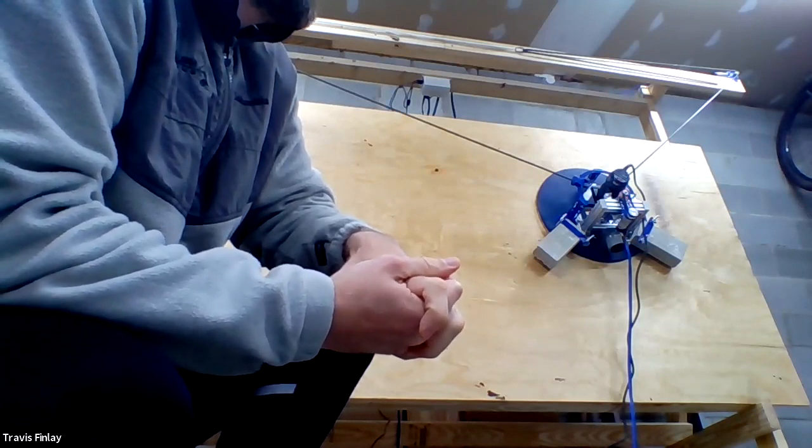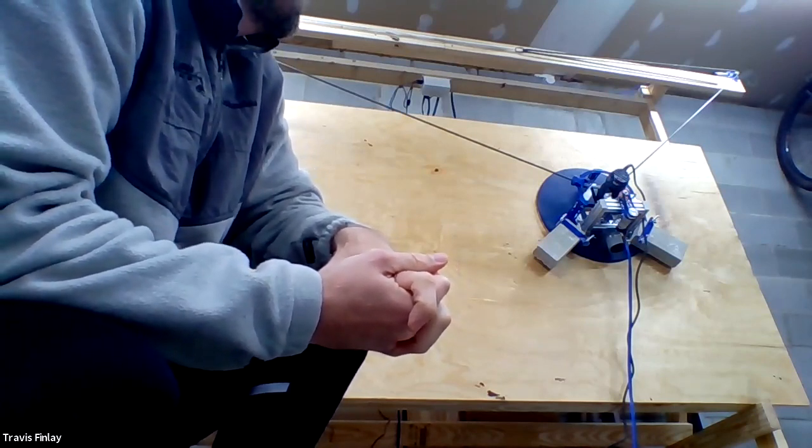All right, so on your feedback in the Makerverse application itself, what is your XY position that it's reporting? So like if you say, hey, I'm at 0, 0, I want to go to X150, Y0. When it gets to that position, does it report that it's at X150, Y0? Let me share the screen just so you can, oh wait, it's disabled. On the upper right of my screen, where it says machine position and work position, those both say X 24 inches, Y 0. Okay, perfect.